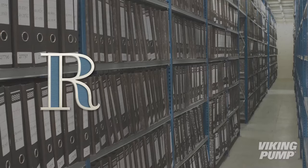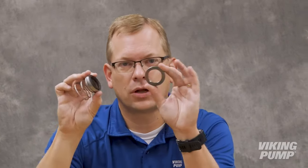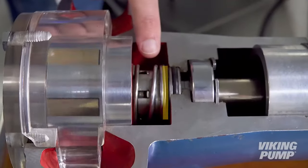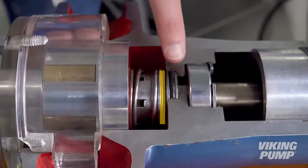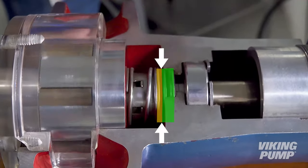You're watching the Pump Report. Of all the seals I've covered so far, mechanical seals are the most complex, but I'll try to stick to the basics here. Mechanical seals consist of two basic parts called faces. One face rotates with the shaft, while a second is held stationary in the pump housing. The primary seal is created between these two seal faces.